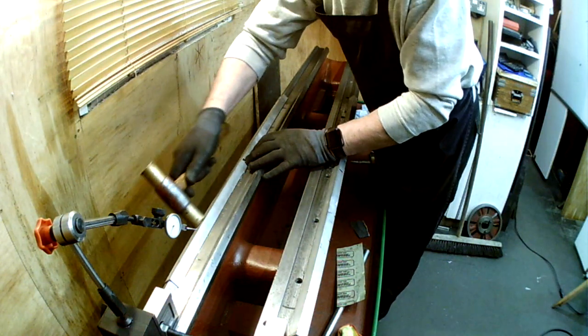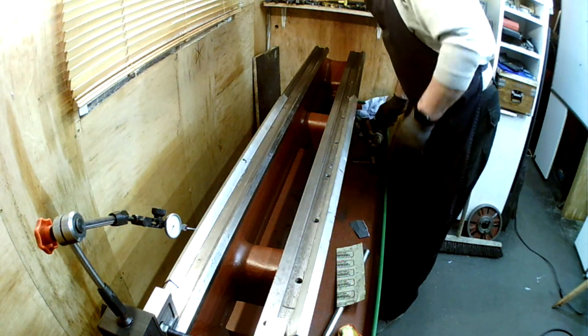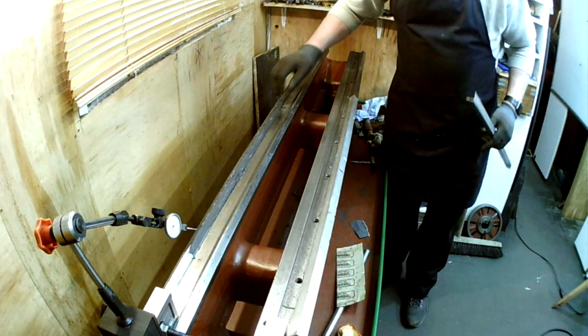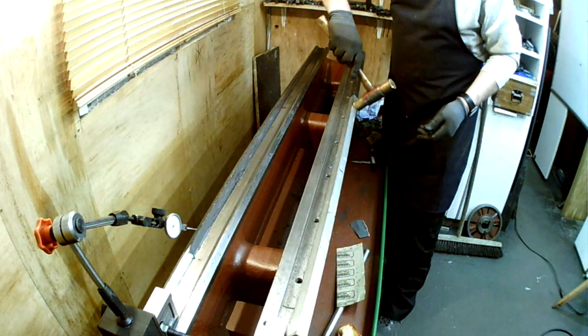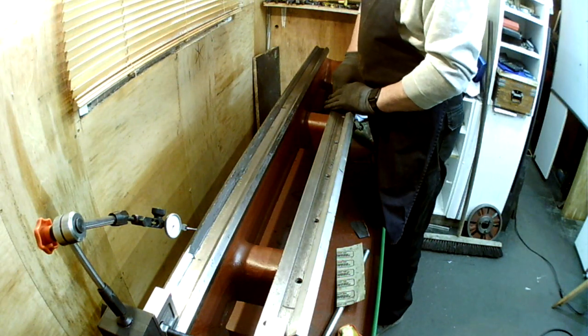The reason I chose to add iron dust to the resin was partly because, to a degree, it self-lubricates and it should, when oiled, help the resin to withstand the wear that it'll be having to resist. And partly because I saw videos adding metal powders to resin to create metal objects. So I thought, why not have a go?